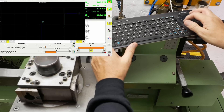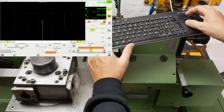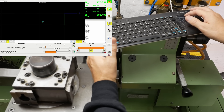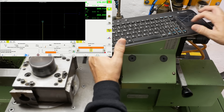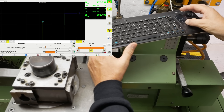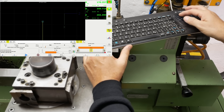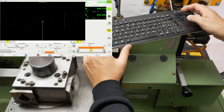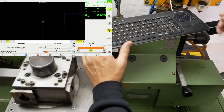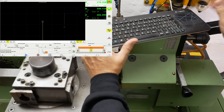While you might think this is a crappy way of controlling a CNC machine — and it is — it's actually worse than that, because what I'm effectively doing is training myself in bad habits. If I start a program and I'm scooting around with the mouse I don't have easy access to a rapid feed rate override. All I can do is slowly move up and down the feed rate buttons, maybe hit the pause button. This is just a crash waiting to happen — training yourself into a bad way of interfacing with the machine. So it's time to make a control panel.